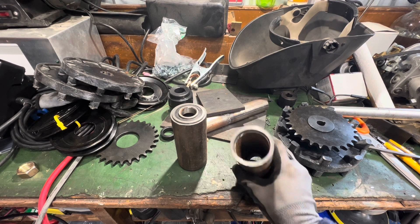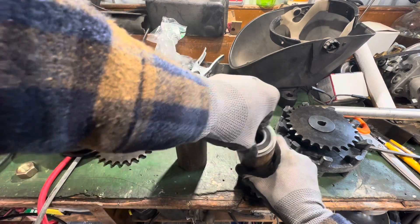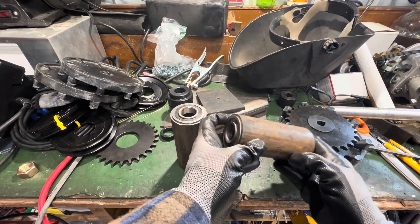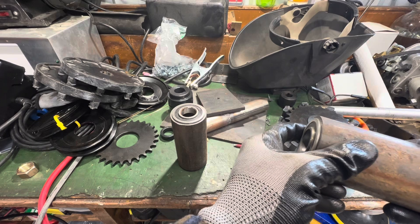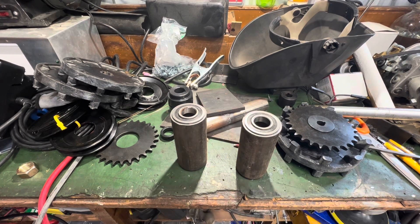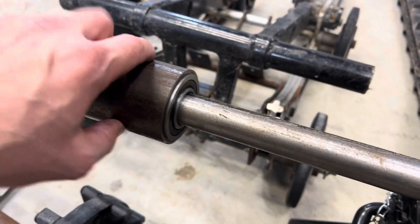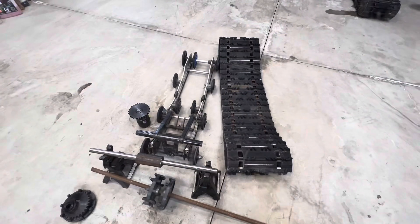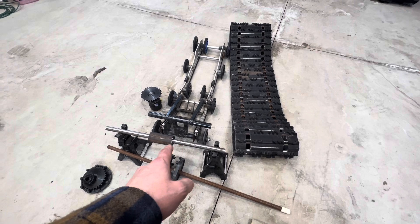The machining is all done and the bearings fit in absolutely beautifully. I wouldn't say it's a press fit, but it does take a little bit of working to get them in there and there's no play whatsoever. Those are basically ready to go — a nice tight fit. The next step is to work on getting these mounted onto those drive axles and getting everything aligned for the driveshaft. Here is our bearing mounted on the piece of one-inch keyed shaft that we're going to use for our driveshaft — this is going to work out really nicely.